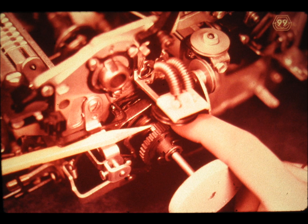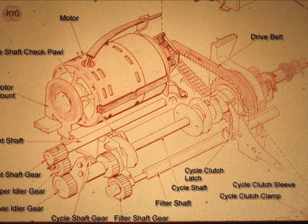You should always dismantle the clutch before you attempt to change the position of the overthrow stop. With this, we conclude our discussion of the shift clutch. As mentioned, we have to use the same theory of operation again to explain the operation of three more clutches in this electric typewriter.